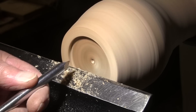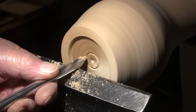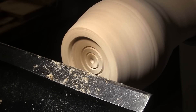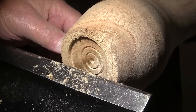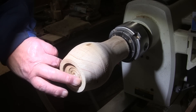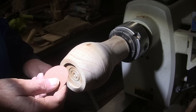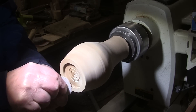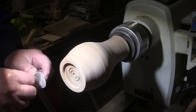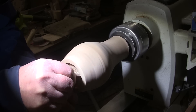Now I'm going to use this dovetail tool to put a dovetail on the inside of this recess. And then to disguise my hole from the bit, we'll put a couple of decorative rings in here. And that's good. I'm getting a little ahead of myself — I'm just not used to doing spindle turnings. I'm going to go ahead and sand this and finish it because it's my last chance to do it on the lathe, and I prefer to do it on the lathe. I'll use a 2-inch disc, hand held, starting at 80 grit and work up through 400.